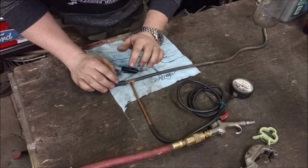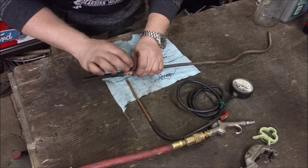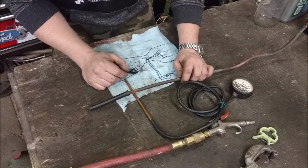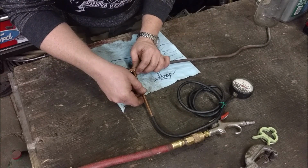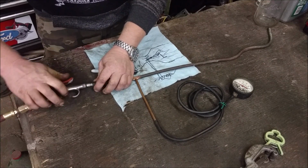But then also, because of this tube, I need this narrower spot. I don't really have a contraption to shrink this tube all the way around. So what I did is I just kind of flattened it. I just took the hammer and flattened it. It's a smaller diameter in there now, and so it creates this little narrow passage. And so I'll just stick this hose right up in there, and we'll just blow right through.